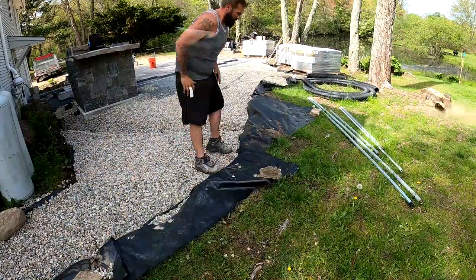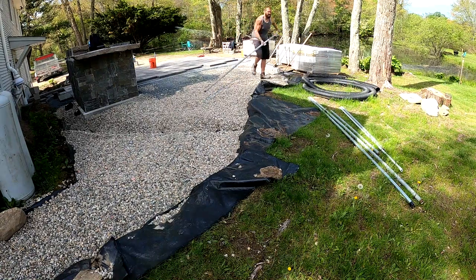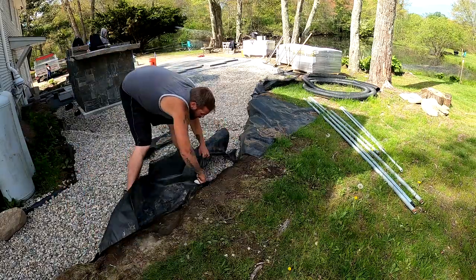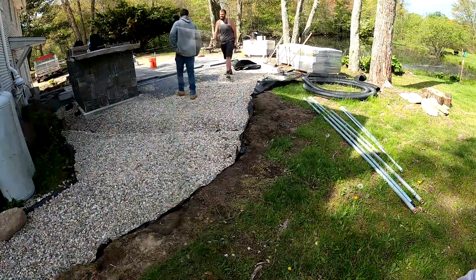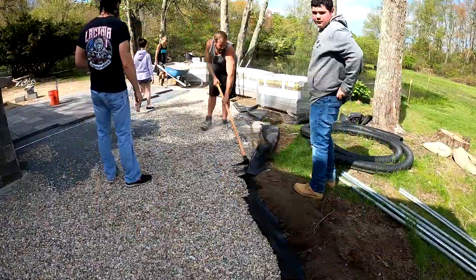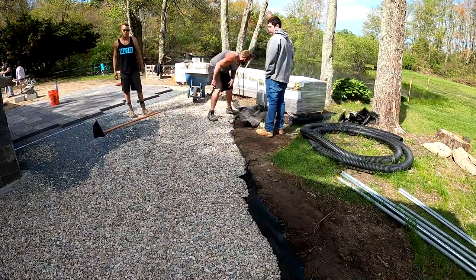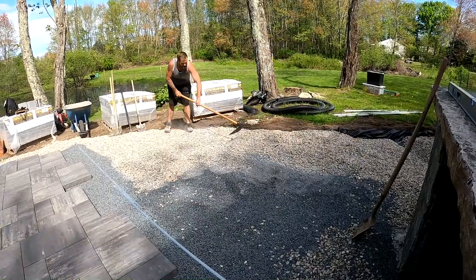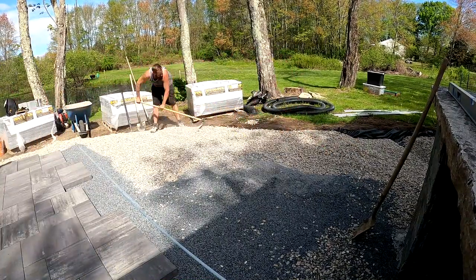All right, welcome back to the people that have been following along in this playlist. We're gonna be wrapping up the patio install today, and as I was explaining before, that flower bed area that we were gonna leave as a flower bed, well, I think we're gonna have enough pavers on site here to be able to just do bricks right up to the foundation of the house. So that's the plan. Right now I'm just cutting all the excess geotextile fabric out of the way so that I can get this stone spread out correctly and put down some more screed rails.